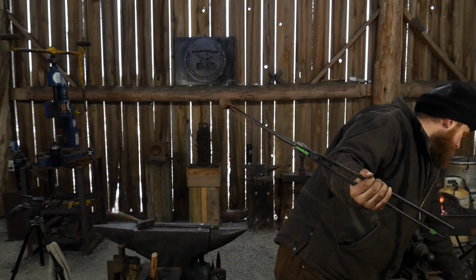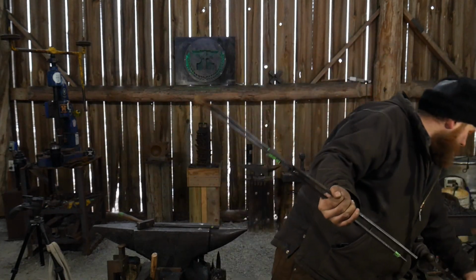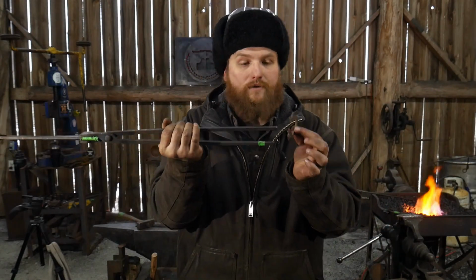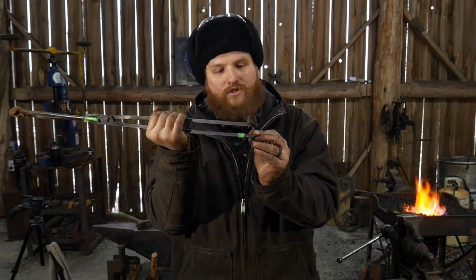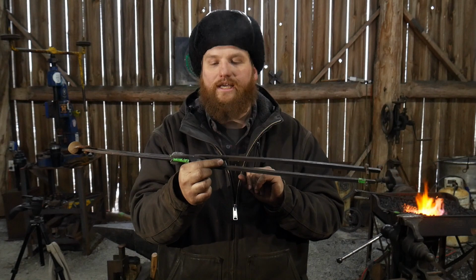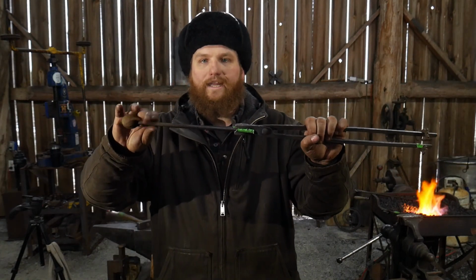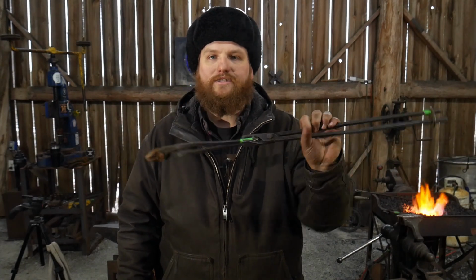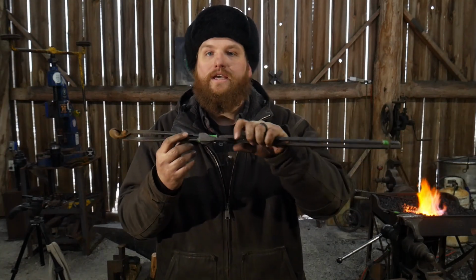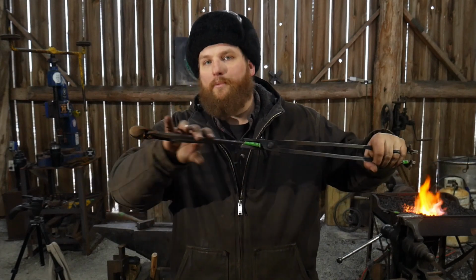So let me grab a tong clip, if you will. Hopefully I can find one that'll fit it perfectly. Too big. Give me a second. So now we can take this tong clip, just like so, and we can squeeze this down and put that tong clip on there so this way we don't have any hand fatigue. And now we can grip this up a lot closer to the jaw while working out here on the end, and now it operates just as if you have a singular bar of steel in your hands without all the stress of having to squeeze way down here on the very end to provide the force.